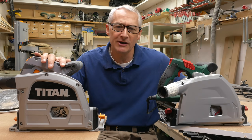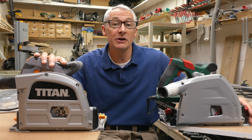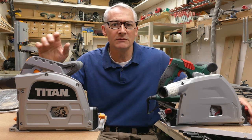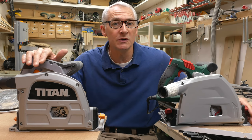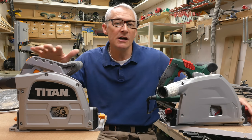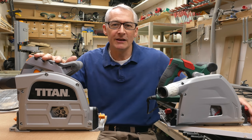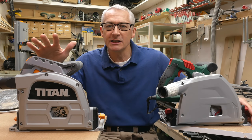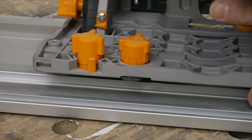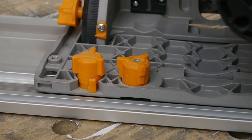The Titan saw has a couple of special features not available on the Lidl Parkside. It has the facility to do a scoring cut — a two and a half millimetre shallow pass — which is very useful if you're cutting cross grain in higher quality birch ply or veneered boards. It has an anti-kickback feature which you can't permanently disengage, which drove me nuts — I took mine off within a couple of days. And it also has a little anti-tipping foot like the Makita saw that prevents the saw tipping over on its side before or after a bevel cut — it doesn't help during the cut, it just stops the saw tipping over.